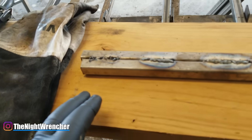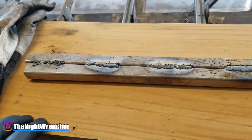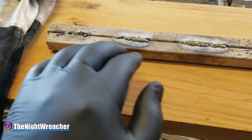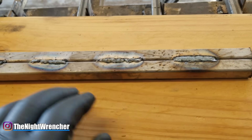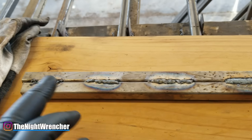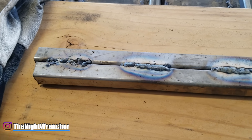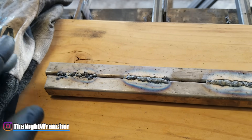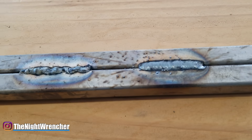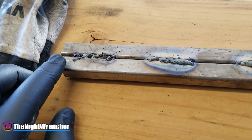We're looking at four different welds that I just did on the exact same machine using the exact same settings, with almost no time between them — I didn't even let the material cool down. I went boom boom boom boom. From just looking at the different welds you'd assume I was messing with the settings, but a lot of the difference has to do with hand control.